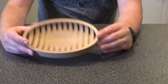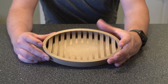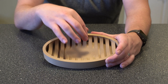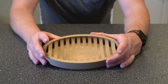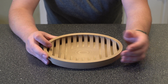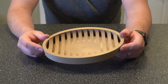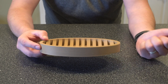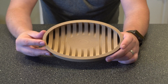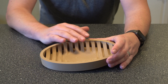The next thing is I've got a completely unfinished bowl here. It's more of a textured bowl — you've got your lines going across, it's really more for decoration. This is untouched, straight off of the printer. You can still see your layers and all of that. I'm going to sand this down, stain it really nice, and then put a clear coat or polyurethane on it and use it for like a key tray or something. This bowl took probably about 20 hours to print at the same 0.2 layer height with a slightly thicker shell. It doesn't look bad off the print, but if you put stain on it without sanding down and getting those imperfections out, it's just not going to look good.